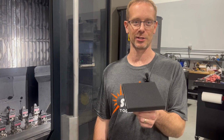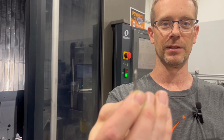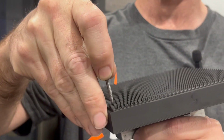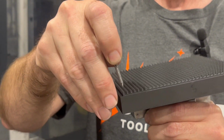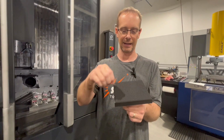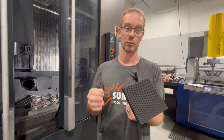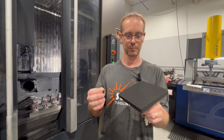Last episode, we had a question I thought was really good. Someone asked, why didn't we take a form cutter and actually put the diamond shape on this electrode? The answer to that question is, we did do that. We ended up trying to cut it, and it's a single flute tool trying to get a very small point. As we were cutting it, the cutter wore quickly. It wasn't diamond coated, and it also chipped the electrode really bad on every little intersection. So we ended up not using that method, which would have been a lot faster, a lot easier. But I did want to answer that question. It's a good question, and that's why.